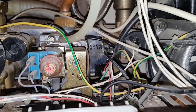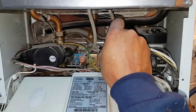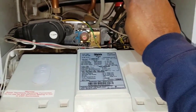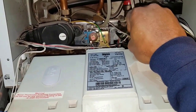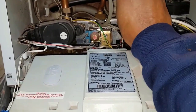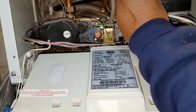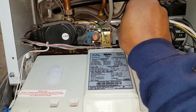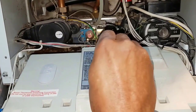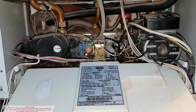So we have to repair the leak and the flow sensor. The leak is basically because of that nut on the pressure gauge tube — it was just loose, just hand tight. I'm tightening it back up like that, and you can see the leak has now stopped dripping down onto the flow sensor. That part was quite simple to do.